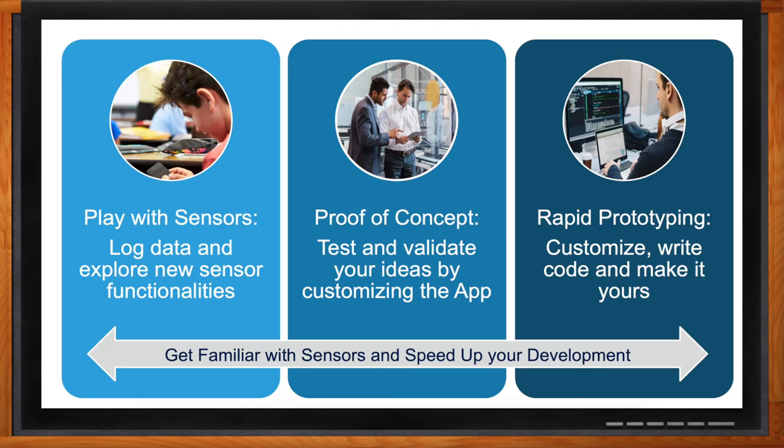So say I have validated a concept — what would the next step be considering the available resources on the Sensor Tile Box hardware? So once the concept is validated, the user can explore the professional mode of the Sensor Tile Box. This allows C programming and lets the user benefit from professional design tools part of our STM32 ODE — Open Development Environment — such as the STM32 CubeMX, a great code generator that allows the user to set up all the peripherals of the microcontroller and also to bring in the drivers of the available sensors on board. Additionally, we have quite a few examples supported by a package called Function Pack, which gives a wide range of application examples or starting points for any customer that wants to design a new product based on the Sensor Tile Box.